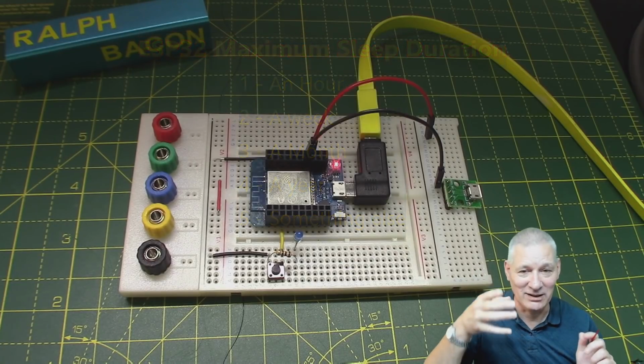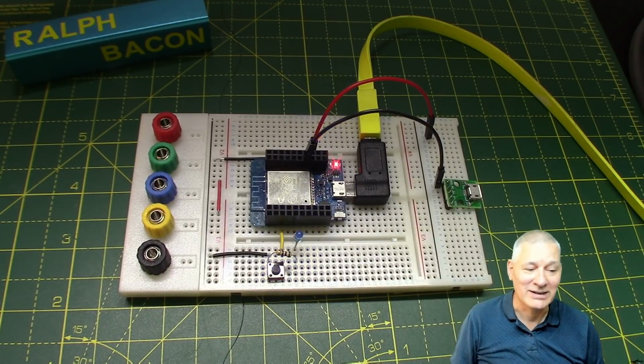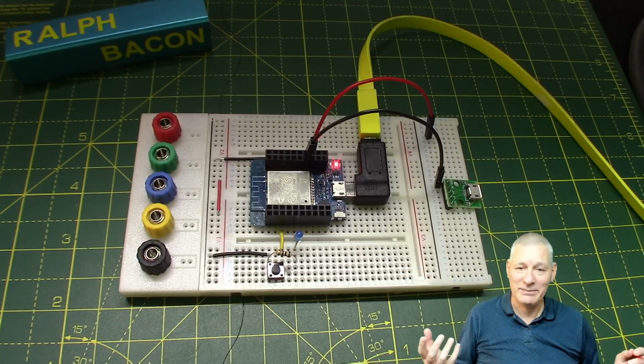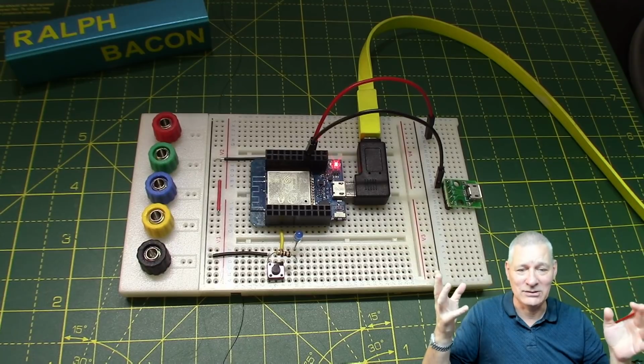And really, 5 years. Well, that's if your battery lasts, of course. Yeah, you can put your ESP32 to sleep for 5 years if you really want. I don't suppose anybody's going to, but who knows. But it's nice to know that effectively the deep sleep time on here is unlimited. It's great. You don't have to think about it. You go, yeah, go to sleep for 2 hours, 24 hours, 48 hours, whatever.